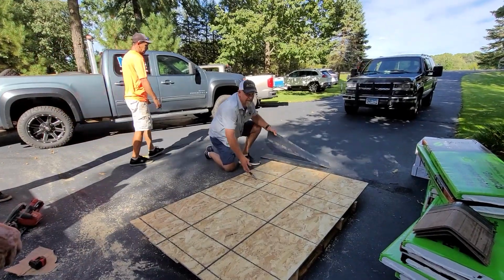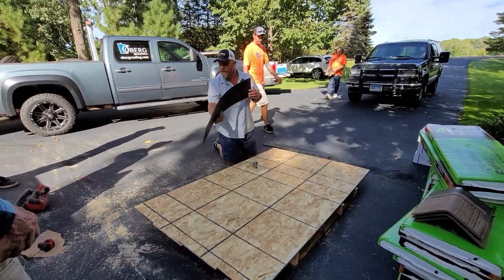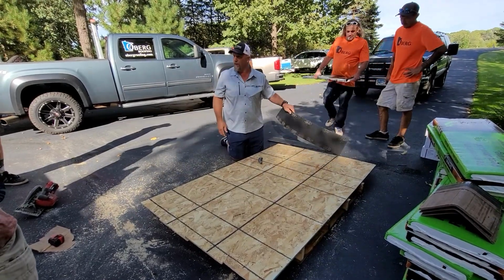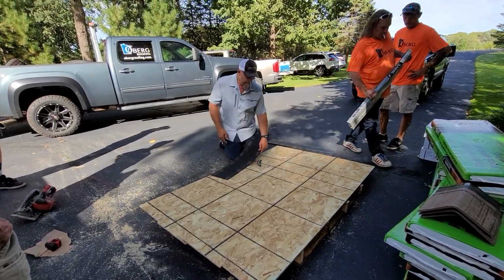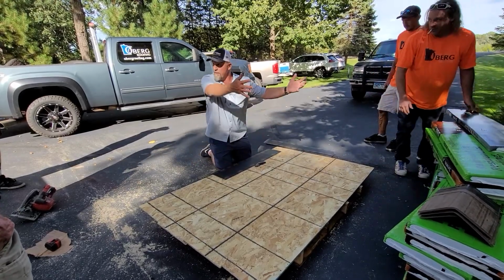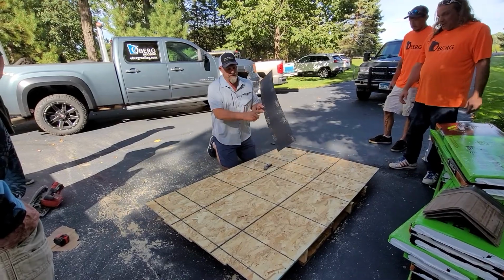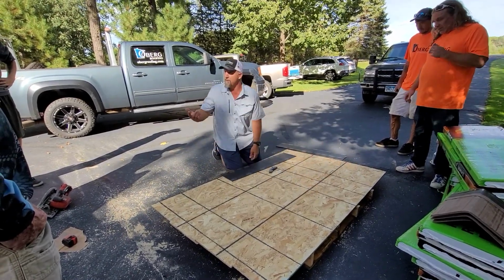You a lot of information, okay? This right here is our starter, obviously. Starter is not used on the rake, only eave, okay? I'm going to treat this as if I'm at the eave working my way up to the ridge. Okay. Make sense? This starter has obviously multiple colors, and the reason why is we have different products.